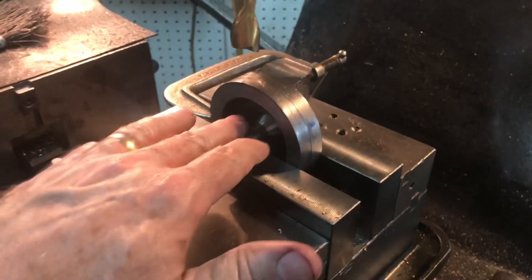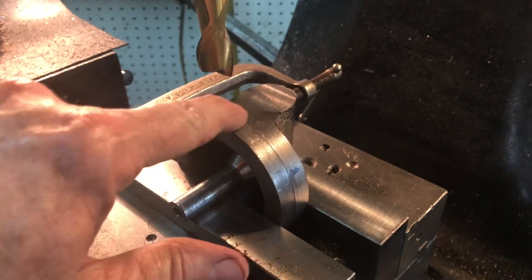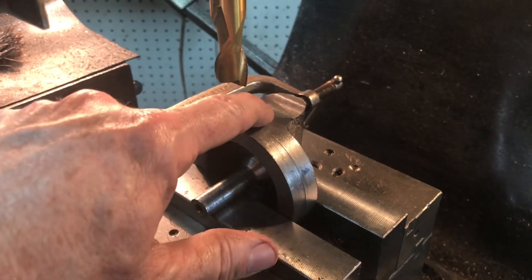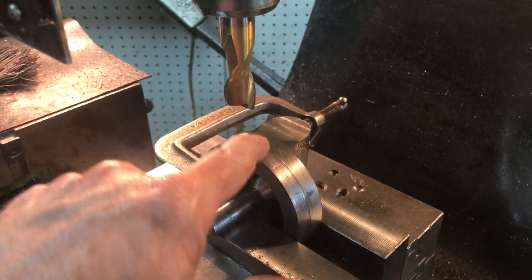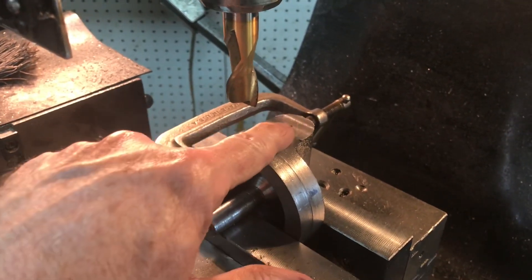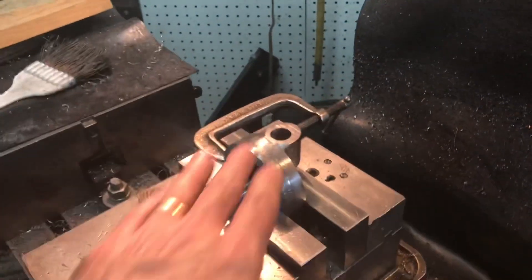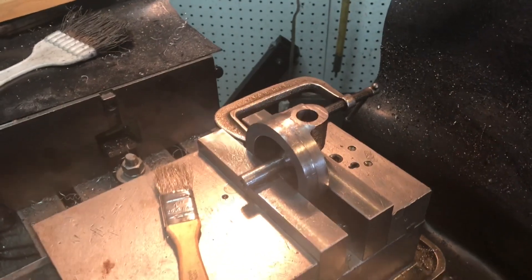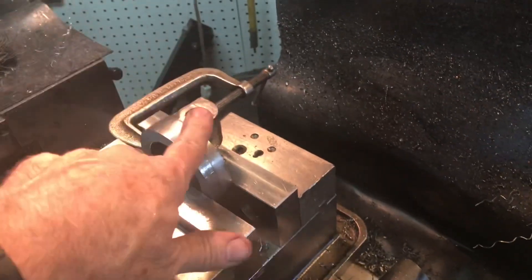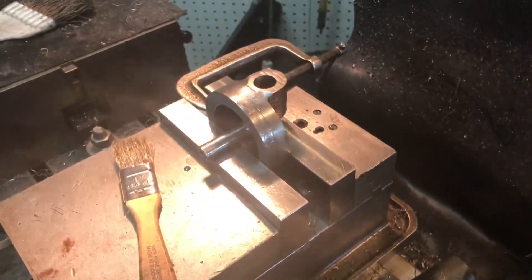I took the rotating base out of the lathe. I've just machined off the flat, made it flush with the rim that'll be turned. The next thing I'll do is offset from the base here an inch and three-sixteenths and drill and bore the 5/8-inch hole that goes through the upper tool holder part. I drilled and reamed out the 5/8-inch hole for the tool holder rod. The next thing to do will be to drill and tap for the set screw through the top.